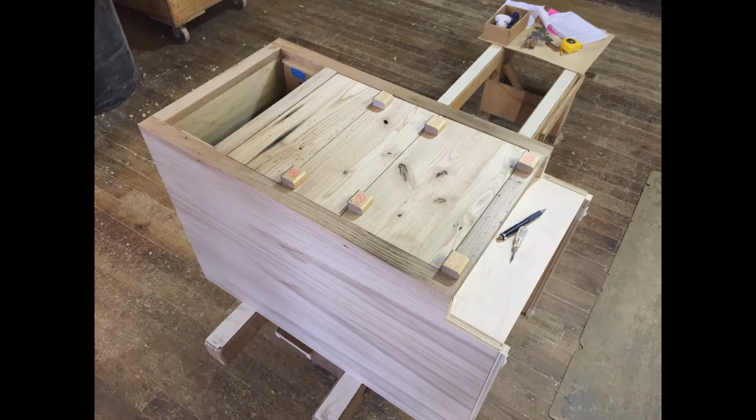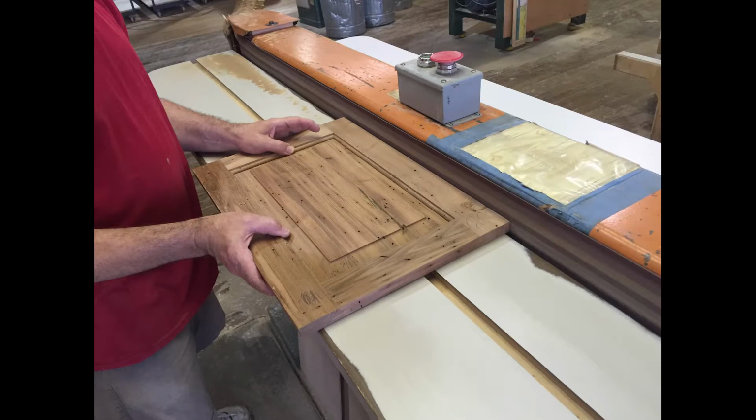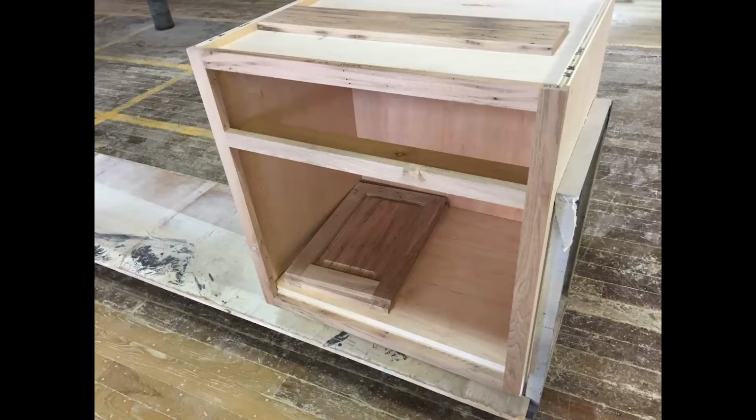After the doors are made and the cabinets are built, the drawer fronts and doors have to be fitted to the frame. That's what this is showing. And here are doors being fitted and sanded with the shims around each door. This is the sanding that is the final fitting process. After that, we drill the back of the doors for the hinges, which are concealed once the kitchen is assembled. It requires a 35mm hole, and here is a finished cabinet with the doors that go with it.